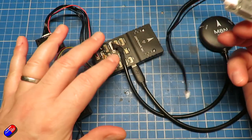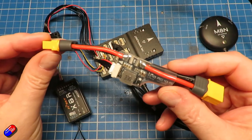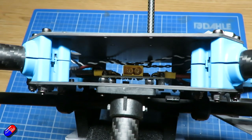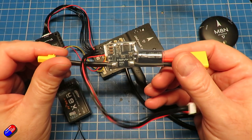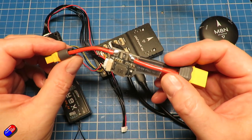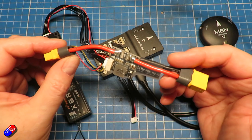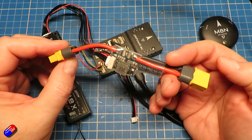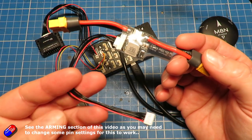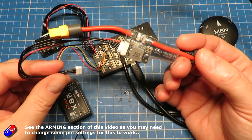Before we install all of the stuff we set up last time into the quadcopter, we need to install this power module. It's going to plug into your flight battery and into the power distribution unit, sending power to the ESCs on the four arms. This is the Holybro PM02 version three power module. It handles 60 amps continuously but can handle up to 120 amps for short periods. It also measures voltage and current flowing through the wires, which can be reported via a wire to your flight controller — very handy for keeping track of how much flight battery you have left. It also provides all the voltages the Pixhawk needs to operate.